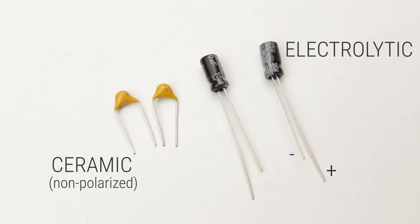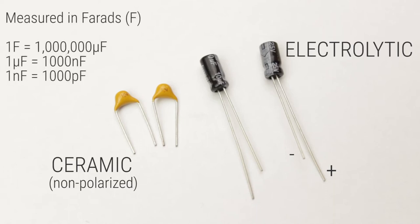The positive leg of the electrolytic capacitor is the long leg. You will also notice that on one side there is a white band which indicates the negative side. There are also numerous other types of capacitors, including polyester, polyfilm, tantalum, paper and mica, to name a few. However, it is only the electrolytic ones that are polarised. Capacitors are measured in farads, but it is more common that you will see them in the micro, nano or pico ranges. On the electrolytics, this value is printed on the side of the component, but with other types you will find a specific code which you can reference.